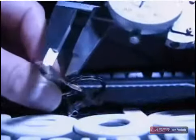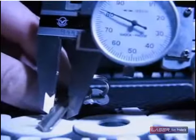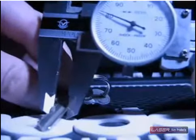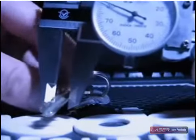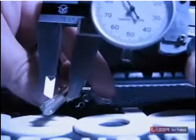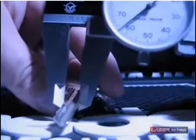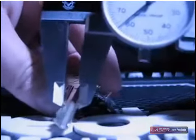So I go to the next cut up here, and we've got two hundred and eighty-two thousandths. And we go to one more key here, one more depth, and measure that — and we're back to two hundred and sixty-three thousandths. So there are two cuts here at two hundred and sixty-three thousandths.